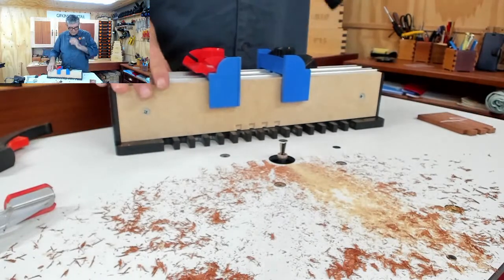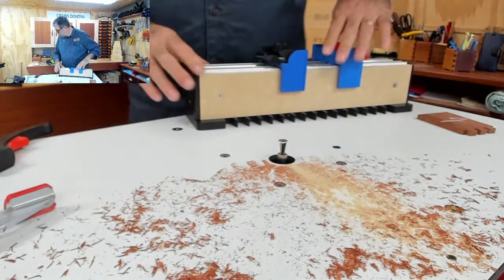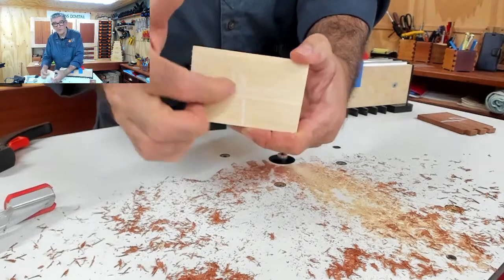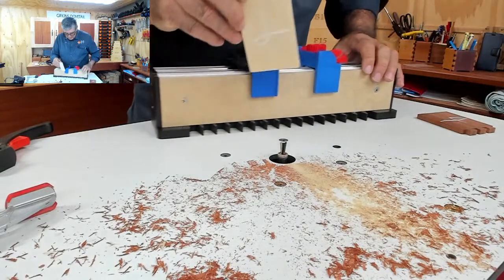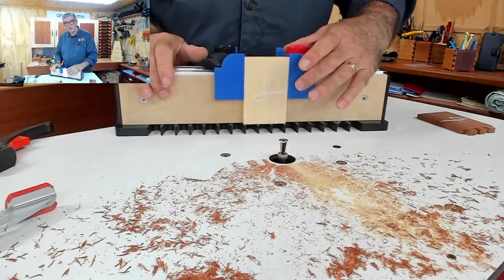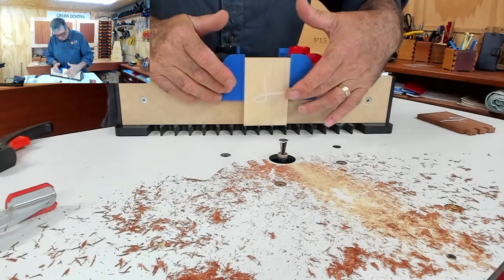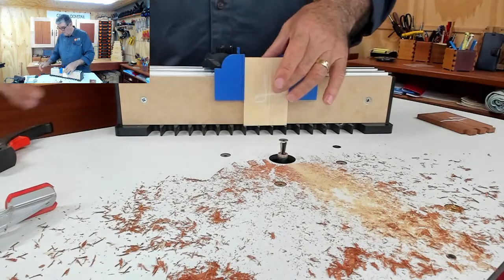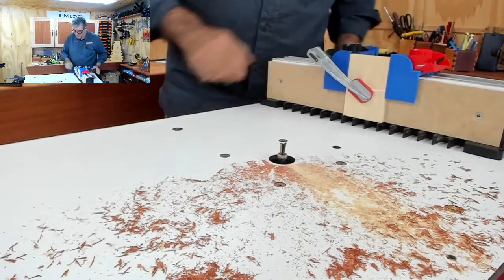When you've done your dovetails, you then turn your jig around. We have our face side mark on the outside, and that's the bottom of the box. I have a habit of putting my timber into the jig with the face side mark pointing out. I should do that all the time anyway. But I also make sure that the bottom of my box is pointing at my red stop. Okay? Right. So, lock that in. And now I need to change the router a bit.